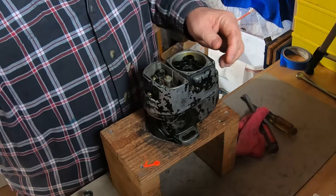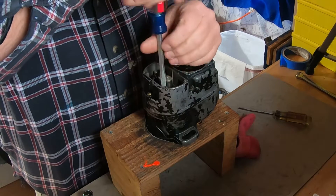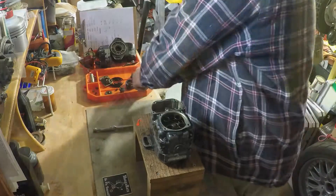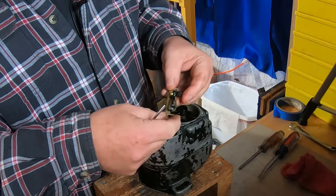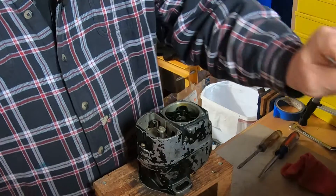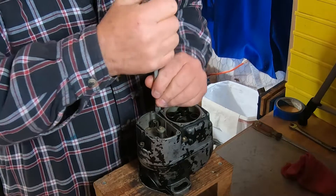This condenser has a metal stamp part number, which tells me it's older than the hills on its own. I'm kind of doing a little archaeology on what I'm taking apart and finding that this particular magneto has not been serviced or had any love given to it for a very long time. The points that came out were original Bendix points. By the condition of these screws and what it takes to get them out, it's telling me this thing has not been looked at in a long time.